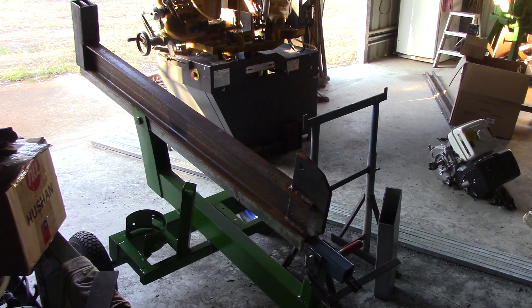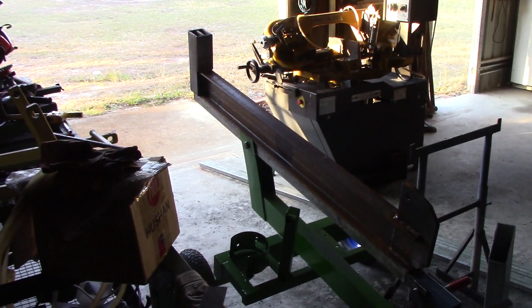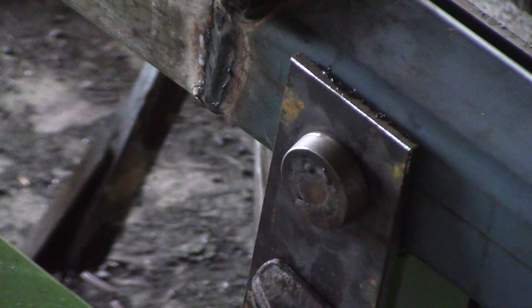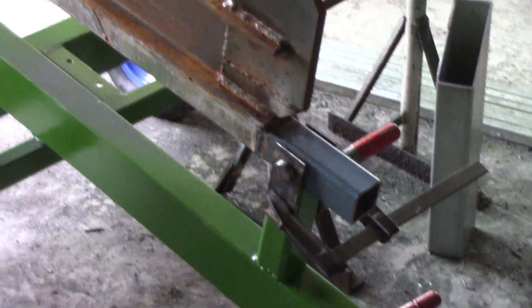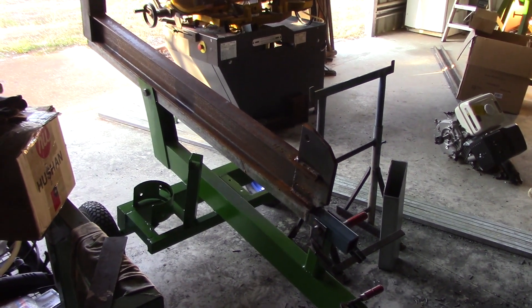I've sat the top bar on the trailer frame now. I've got that pin in there in the back pivot point, and I've got another pin through there, and I've clamped the two side plates on in position so that everything's lined up perfectly. I'll tack them into position now and then I'll weld them.